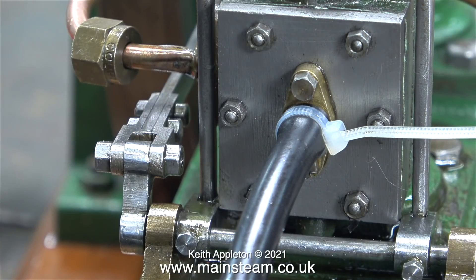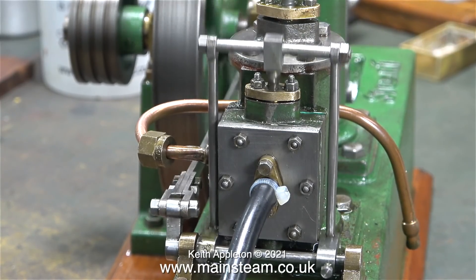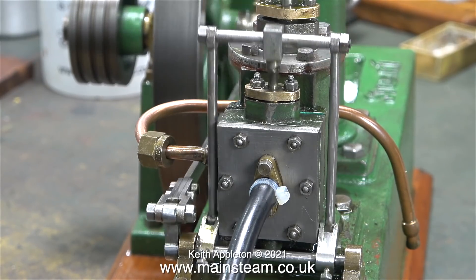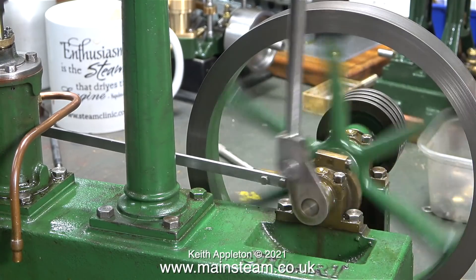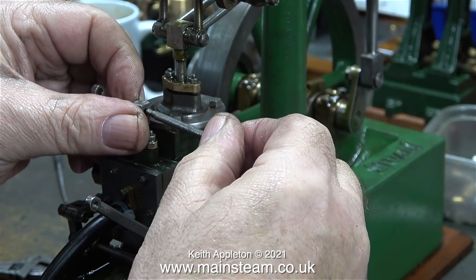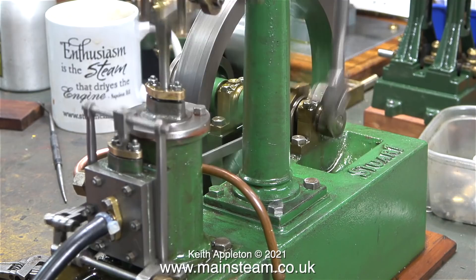Time to give it a try. I've reattached the airline, fastened it in place with a cable tie, and then chopped off the end so I don't poke my eye with it. It's working a lot better. The shim on the valve means the engine will now run very slowly, because before the slide valve was so far away from the port that as I reduced the pressure it just fell off and the engine would stop. The new state of affairs is also revealing a problem — the timing is very slightly out, which I couldn't check before because I could not run the engine slowly enough to identify what was happening.